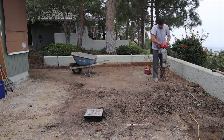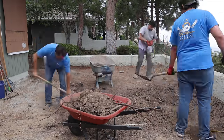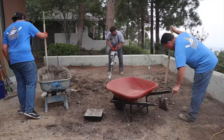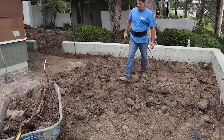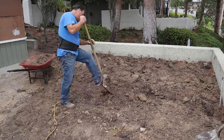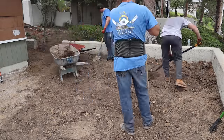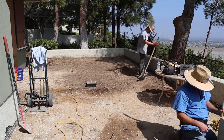Back on site after that load went out. The concrete we removed was sloping toward the existing drain, so the elevation below that concrete is probably going to be pretty close already. All these planter areas we just have to bring down to that grade. My initial thinking is to just bring it down to what we had before, because it looked like it was working. Once we get there we'll verify everything with the laser level.